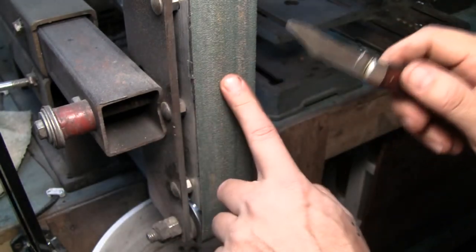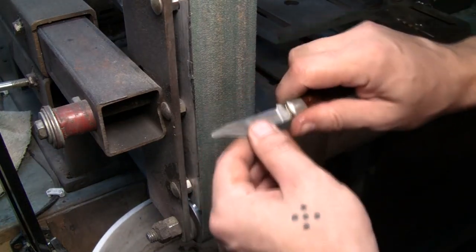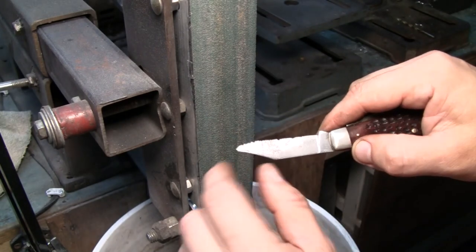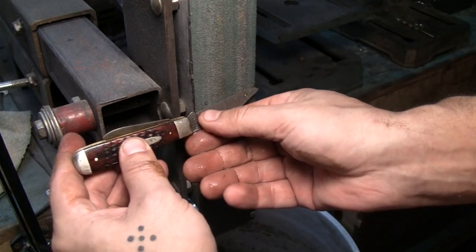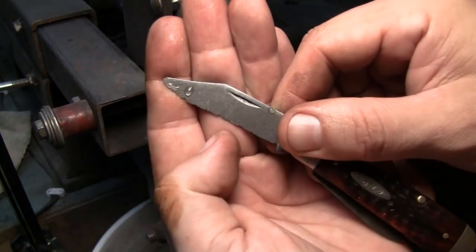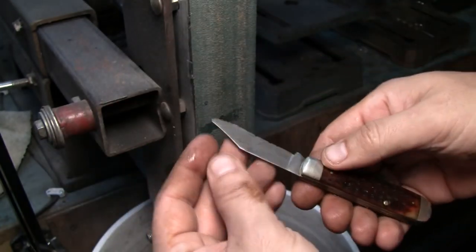So I have here a very fine grit sandpaper. I'm gonna wet the blade, of course, so that way I don't ruin my heat treat, and I'm just gonna lightly go like so until I'm satisfied. I'm not going to go all the way to top because I still have to sharpen it, put a secondary edge on here. So what I'll do is get it close enough to that, okay? And then the secondary edge will butt right against the top of it. At least that's the idea.